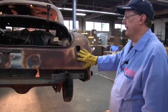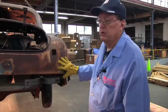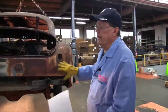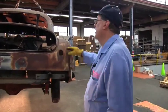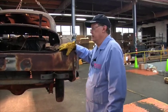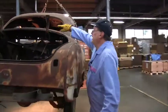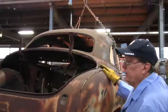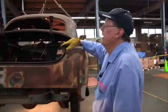That is everything. So what we're going to want to do is as you put your tail pan in, some guys tack it in. They got fancy clamps. I use a couple of pop rivets just to hold it in place. Make sure my trunk lid closes. Now you got to remember, on some of the older cars, the hinges were worn out, so when you close your trunk lid, it'll wobble down here. You got to either make an adjustment for that or get some new hinges, fix it.